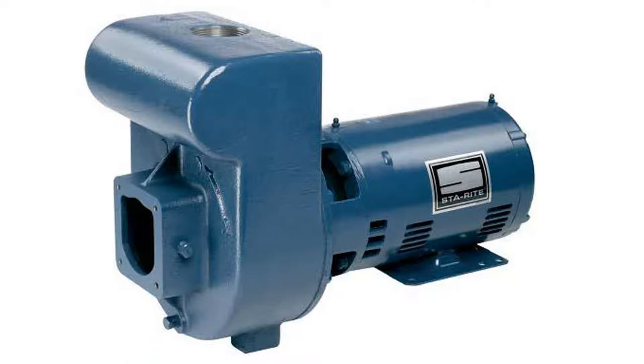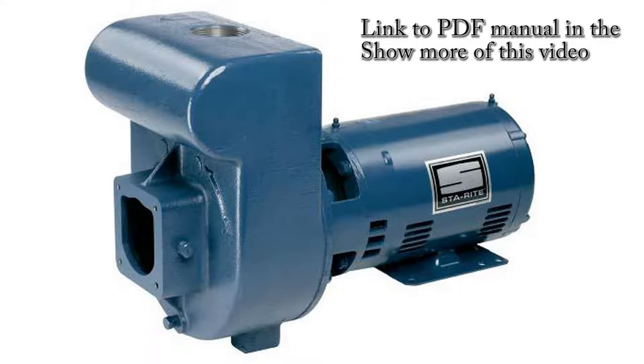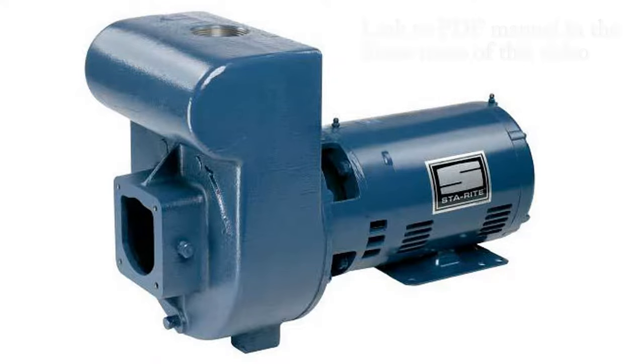First, let's talk about the types of leaks. You could have a face gasket leak where it's leaking around the bolts, or a shaft seal leak where it's leaking around the motor shaft. There are also leaks that occur when the volute cracks — it could crack because the pump overheated or if the water froze inside the pump. Make sure you don't have cracks in the volute housing first, or else you could replace a seal and still have a leak.